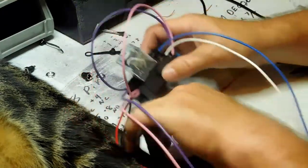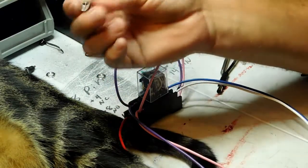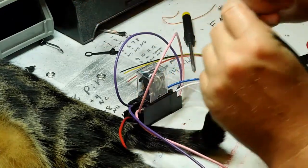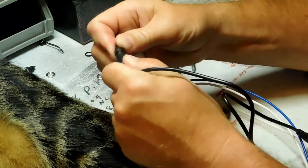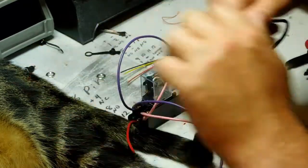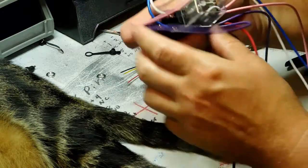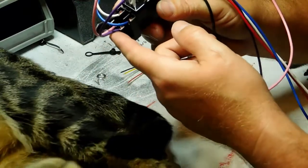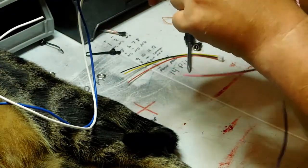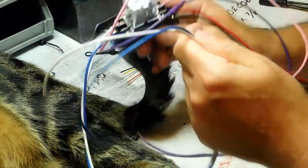When you plug in the power supply, you'll have two connectors - one for your battery charger and one for the power supply. When you plug in the power supply and plug it into the wall, power is supplied through the pink and purple wires going to terminals five and eight, and you jump from five and eight over to terminals 13 and 14, which activates the relay. When the relay turns on, it disconnects the battery and only allows power from the power supply to come through to your project.